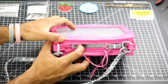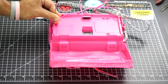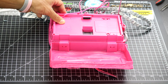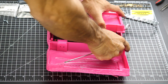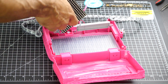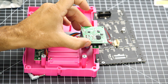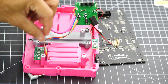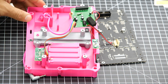Disassembling the purse is surprisingly straightforward. You'll need to open the little latch on the side of it and remove the six screws on the sides using a Phillips head screwdriver. You can then carefully separate the two sides and work with the one carrying the electronics. The electronics are comprised of the LED matrix panel, a power regulator board, and the main controller. We see the little silicon chip where all the default patterns for the LEDs are stored. We're going to be replacing it with the ESP32.